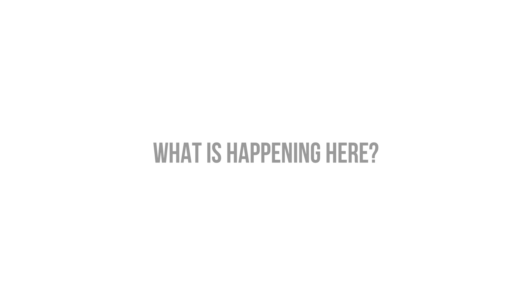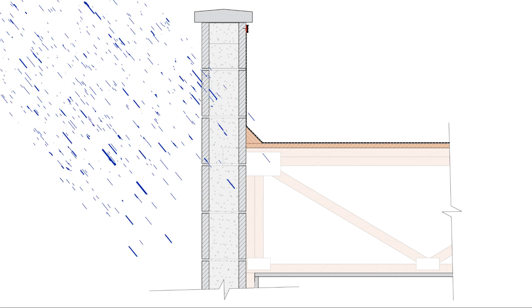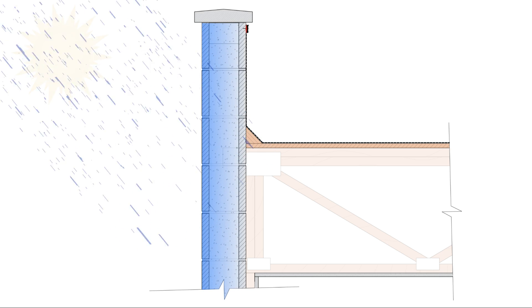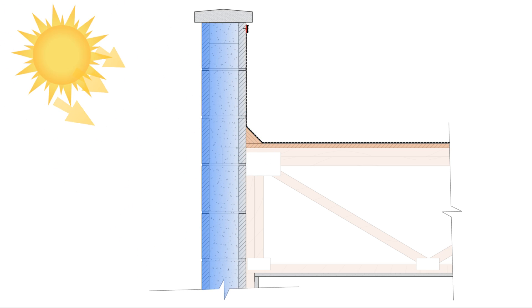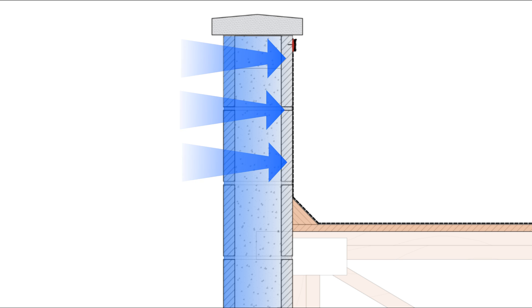What's going on here is that moisture is being stored in that exposed concrete block or masonry wall. After a rainstorm saturates the block wall, when the sun comes out, heat hits the wall surface and some moisture evaporates to the exterior — but a lot of it is driven to the inside. That's why we have a dimple mat on the interior. But when moisture is driven into the roof membrane lapping over the parapet, we get condensation.